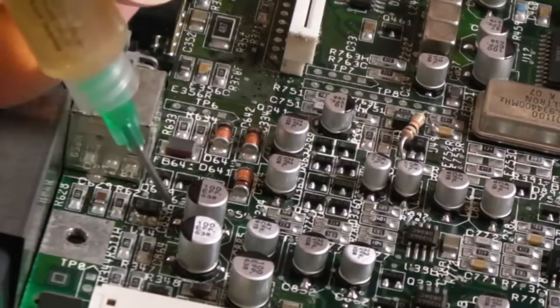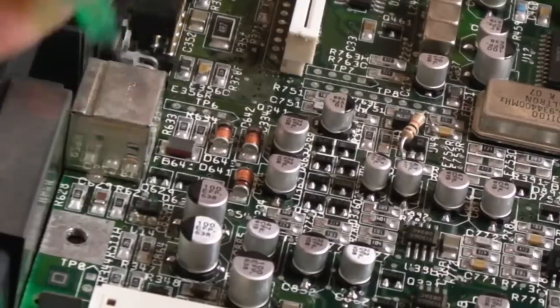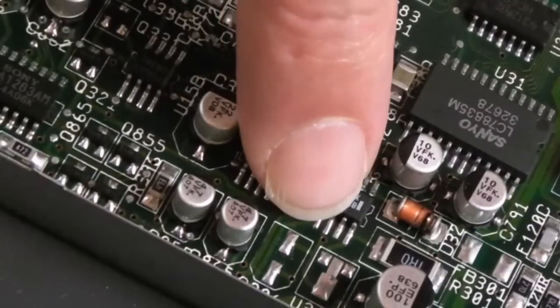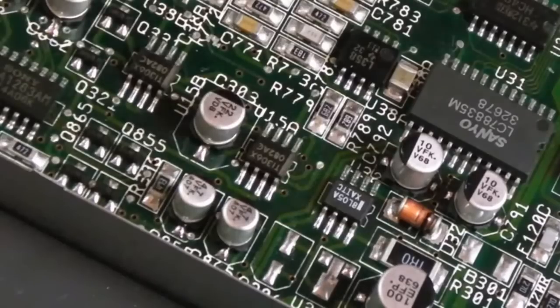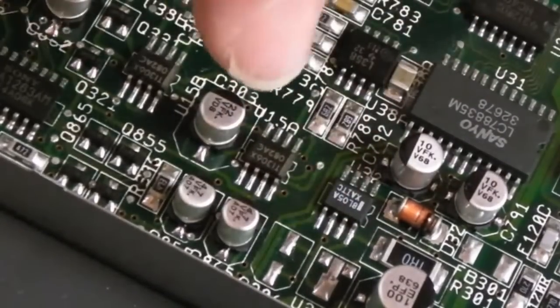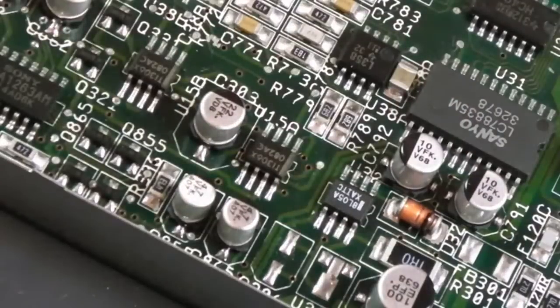For good measure, we'll do the one on the back of it as well, actually, the tab. And then the other thing I'm going to do while I'm here, you could argue it's pointless, but I'm going to do it anyway. Yeah, the missing capacitor down here, I looked at the schematics, it's supposed to be a 10 microfarad one, although it's not marked on the schematics as 10 microfarad compared to the 1200 schematics. It's on the Paula supply rail, and it's got the same caps as the 1200, except for that, they removed it. So, I don't know if it's a cost-cutting thing or what.